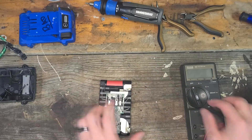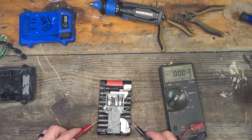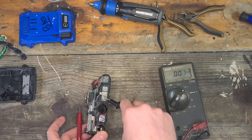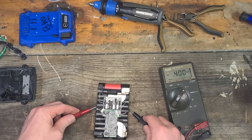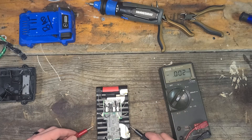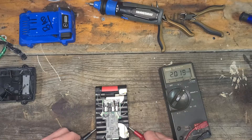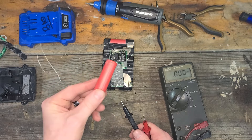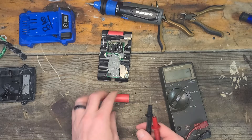Get a good workstation set up and you can just test the sides of each battery — they can be connected or not. As you can see, just touching off on these: I got 0.4, 0.29, 0.2. The only battery that had any juice was this one at 2 volts — well, minus 2 — so definitely not doing good. And just to confirm, this is the battery I took out of it. The reason I took them out is because they were good — look at that, 4.14 volts. So you can see which batteries are bad.